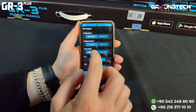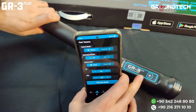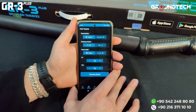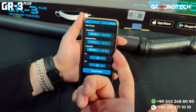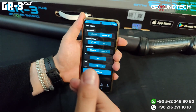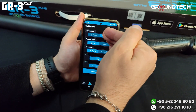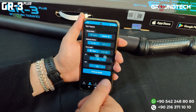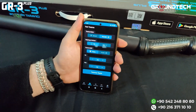With GR3, you can only scan while holding it vertically. Scanning while holding horizontally on the rocks is not possible, so don't try it. There are 3D manual and automatic search options, and for different searching methods there are two options: zigzag and parallel. For manual search, at the bottom of the device handle there is a trigger button. During manual search, for each step you must press the trigger to scan the zone and get data.